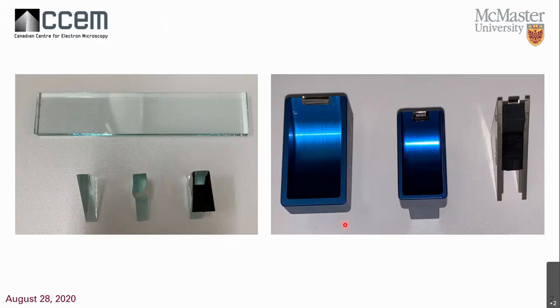The different diamond knives shown here include the histo knife, which has a large diamond edge about 8 millimeters in length, used for thicker sections from about 200 nanometers up to about 5 microns — beyond that you would damage the knife edge. The ultra-thin knife has an edge length from about 2.5 to 4 millimeters and is for sections of 150 nanometers or thinner. The knife on the right is a cryo diamond knife — it has no water boat — and I'll discuss cryo sectioning shortly.